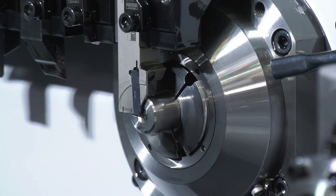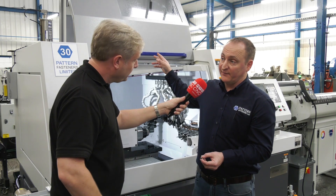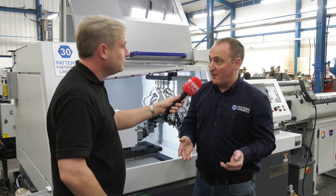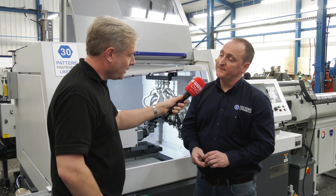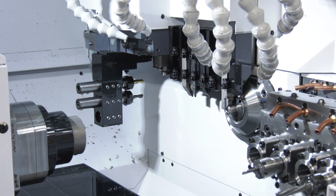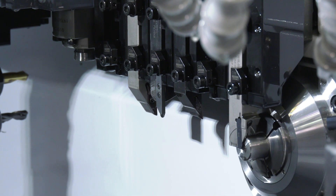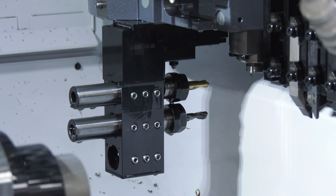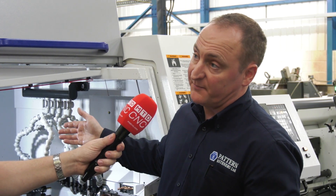Now we mentioned the L32 but you can go guide bushless as well? Yes you can, we're doing that on the L20 actually at the moment - saves you some material, so on a job that's 50,000 parts you can save quite a lot of material with the short remnants you get using the machine that way. Now the machine itself - what have you got going on in the envelope here? So we've got a number of driven tools, a number of turning tools, driven tools on the front, driven tools on the back. B axis as well? Yes, manual B axis, so we're able to drill on the front which frees up the sub spindle for back working whilst you're drilling the front of the part.